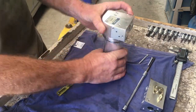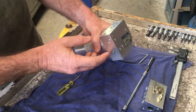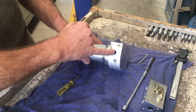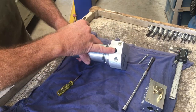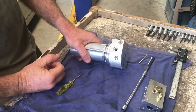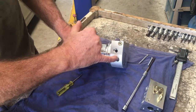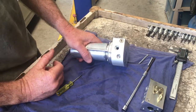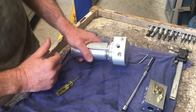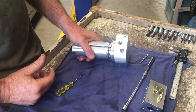And then this bit here is the actual pump itself. To actually remove all of this, there are a number of hexes around here. Obviously the one in the middle there is for the fill and drain. Some of these — there are a couple that are empty. A couple of them just have a spring and a ball just as a check valve, so I don't think there's too much point in removing those. This one here, which is filled with plastic on the inside, I think is the main pressure-regulating valve. So just don't touch that at all, because obviously that's set at the factory and it'd be nasty if that wasn't set correctly.